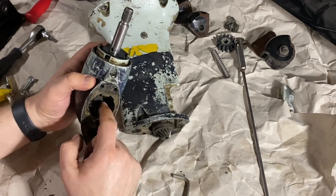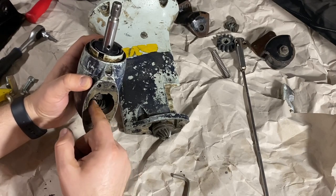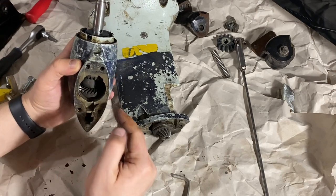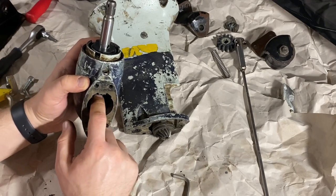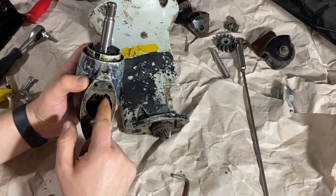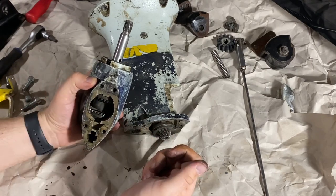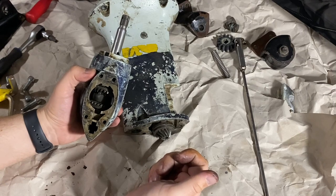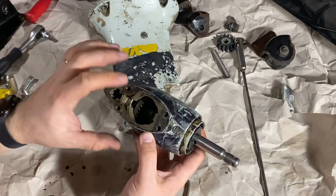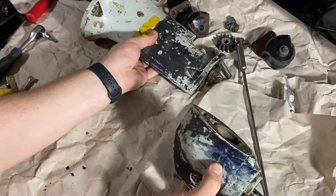Here we have the bottom gears. This side is activated and now if I rotate it, it will rotate the shaft, and this rotates freely. When we push that thing there against this gear, it will connect to the shaft and reverse the rotation. So it's very simple and I think very common in sail drives or outboard motors. This is in quite good shape, there's nothing actually wrong with this especially this one. I'll put this away now.